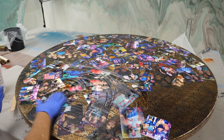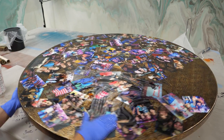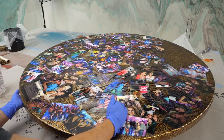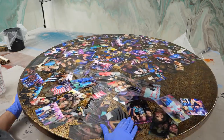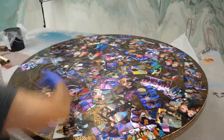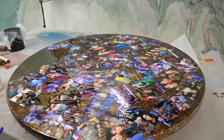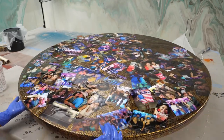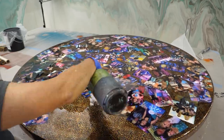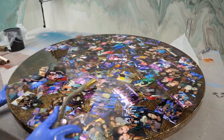The Mod Podge has dried and it's the next day. I'm coming back now with Stone Coat Countertop Art Coat, using three ounces per square foot and spreading it out evenly with my hand. You don't want to use a trowel on this type of project because you don't want it to catch the edge of those photos and possibly cause them to lift. Once I get all the epoxy laid out, I'll make sure I take my hand and roll that epoxy up underneath the edges so that my entire table is coated 100%. I'll torch three times to ensure I've gotten all the bubbles out and let it cure for 24 hours.